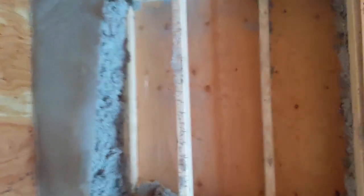The neat thing about removing the insulation was that we got to check whether it was still holding up after all these years. And it was — we were able to cut the holes in the walls and the cellulose didn't fall down on its own. It stayed in position, which is an indication of how well it was dense packed. We'd done testing and verification during the original insulation process, but it was fun to go back about six years later and confirm there was no rotting, no mold. The framing and sheathing looked really good.